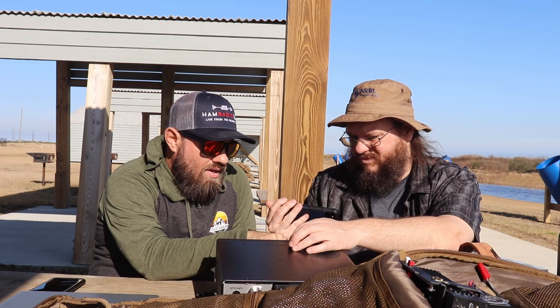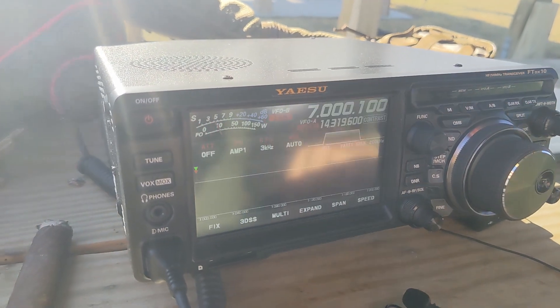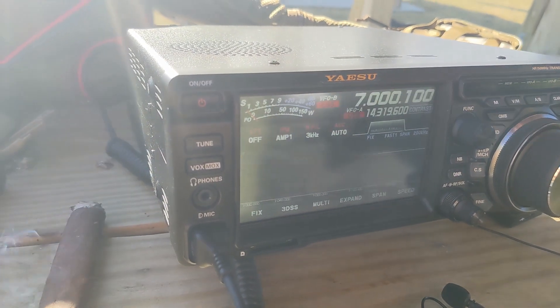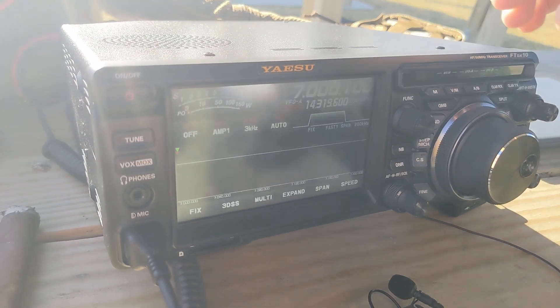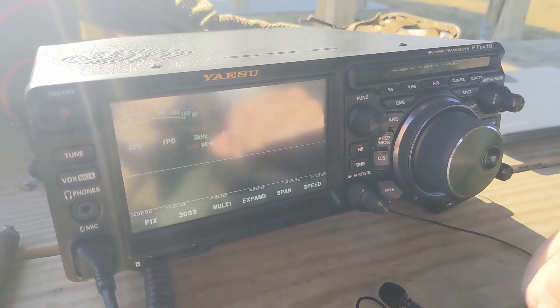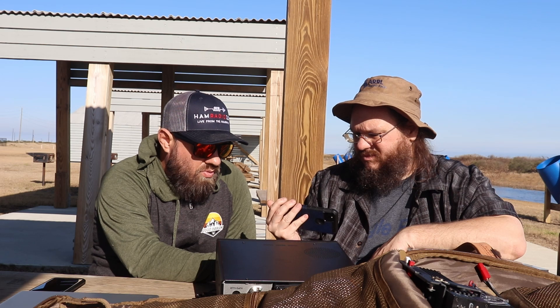Those are your main features — the AB setting, for example, is cool. If you have an antenna resonant at 10, 15, 20, and 40 meters, and you're using 40 but also want 20, you can easily switch back and forth between bands. There's a DX station on 7.215 working a pileup — you can listen, then go back to 20 to call CQ POTA, and check back on him as band conditions change. It's cool to have dual VFOs like that. This is your noise blanker, which will eliminate RFI around power lines.